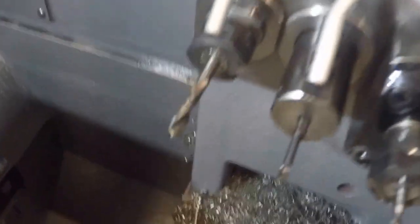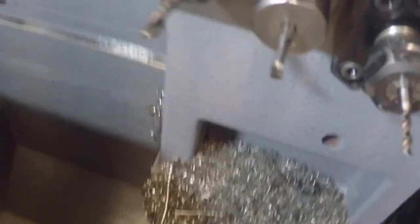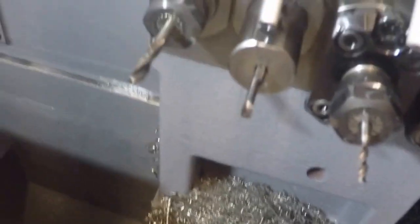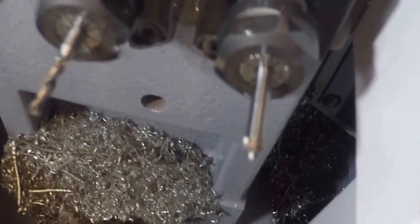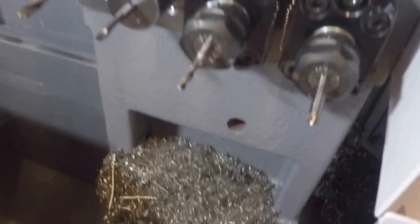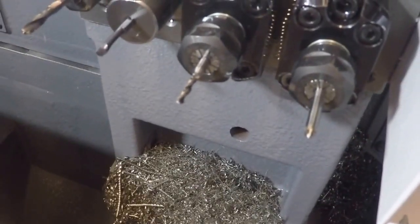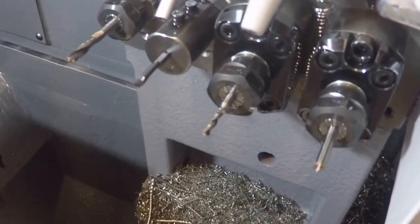And then on the back we have a drill, a little boring bar. It's an eighth inch, or like a 110 minimum diameter boring bar. A little drill, and a 78 thousandths drill, and a little 60 degree chamfer tool on live holders. We use live holders here mainly because the other jobs that I run use live holders there. And since they're just little drills, we just throw them in the collet and use them.